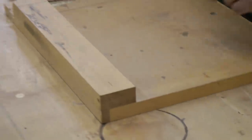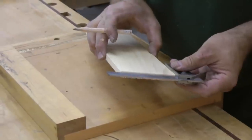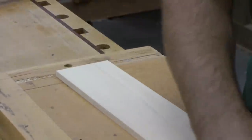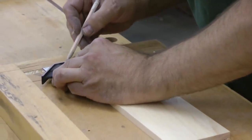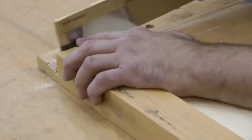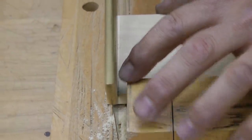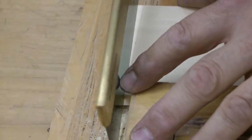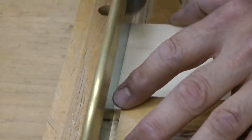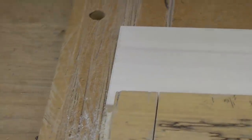See the back side — next to nothing when it comes to tear out. I'll clean that up a couple of times on the shooting board and that'll be perfect. I like to start the saw on a bit of an angle because I'm starting here and then as I saw, I can pivot from this kerf and track right along that line until I get the kerf started on the top. Then make sure you're holding your saw plumb so that you don't undercut and end up going below on the opposite side.